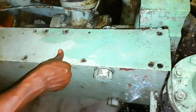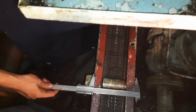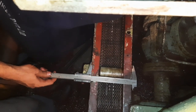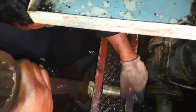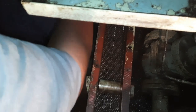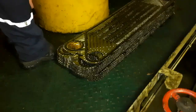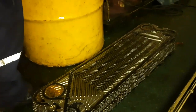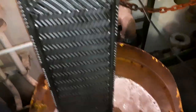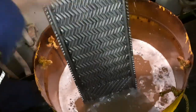After that, we are now draining lube oil from the lube oil cooler, then removing the safety guard from the top of the lube oil cooler casing. Before dismantling, we must take measurements nearest to every securing bolt area. If you take more measurements and record the readings, it will help you more. Take out the plates in serial order and keep them in serial.